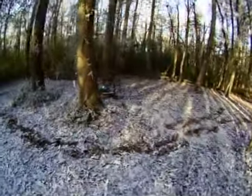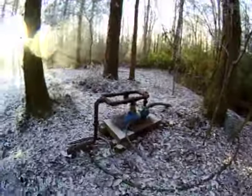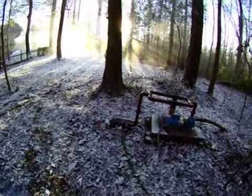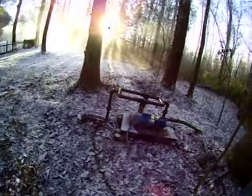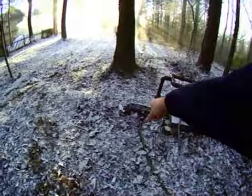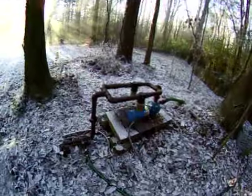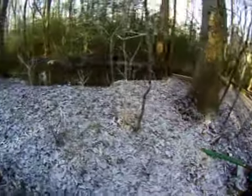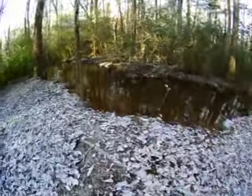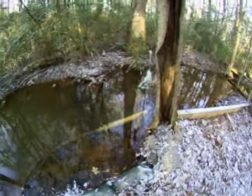Here's the pump that supplies the water from the creek to make the snow, with a couple of strainer filters and up the hill to the box that has the other filtration to get all the particles out of it. Then a little return line here that goes back to the creek — it just helps keep water running through the pump head so we don't heat the water up, because it'll pump a lot more water than what I can make snow with. And here's the creek with the return line going over there, and a pickup line right here for pulling water from the pump.